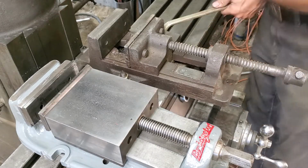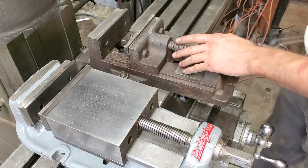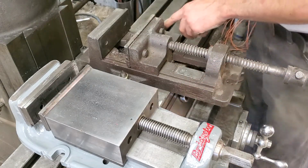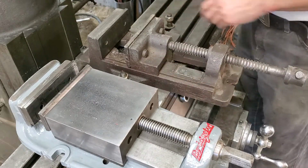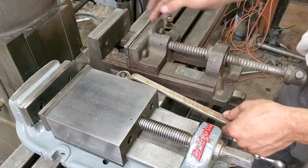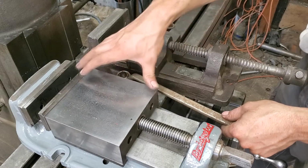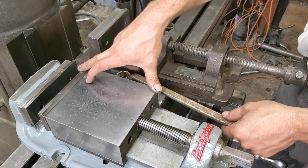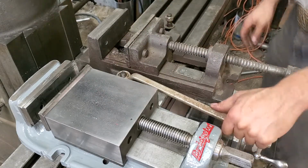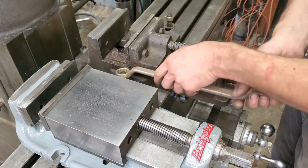we can talk about this old vise I got. This was a drill vise or a mill vise. It's significantly older than this one, but I'm not sure how old because the tag's pretty much worn away. But it's a very similar design. You've got the screw pushing on the jaw to put the whole thing together, and it's trying to use that screw centering up on the work to square everything. You can see in this one they put a lot more thought into stability. There's a lot more bearing surface than in this one with the shorter jaw, but it's essentially the same basic design. And of course we moved away from this design for most of the modern ones.